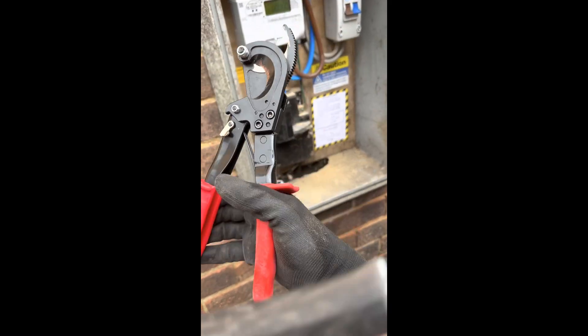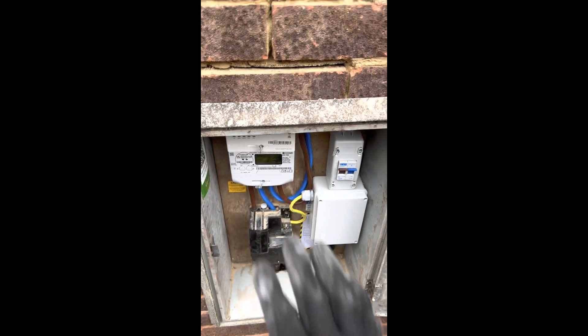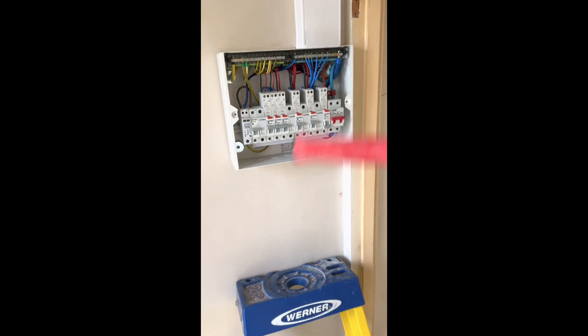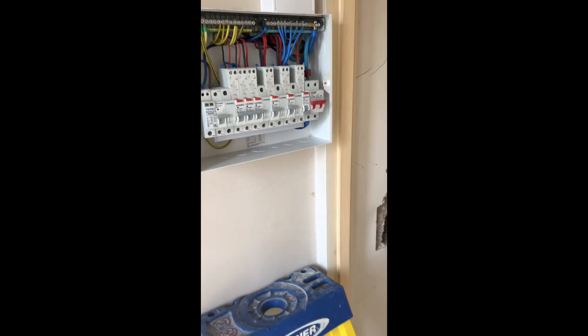On this job I've just relocated the board less than three metres, so I haven't put a switchfuse in because I couldn't fit it in, but I've had to use armoured cable because I couldn't do anything on the inside — behind this wall is the bathroom. So: round, up, through, come straight down — I think I'm about there — then in. Less than three metres. I've terminated it in the back at the top. The gland is armoured, earth is there. I can't use tails, and I don't agree with running cables in cavity — never have done, never will do.